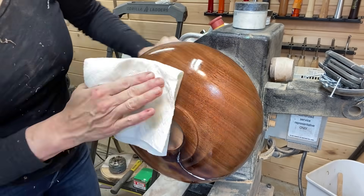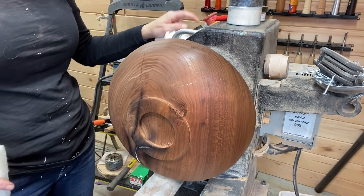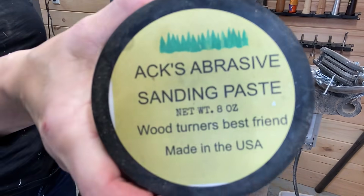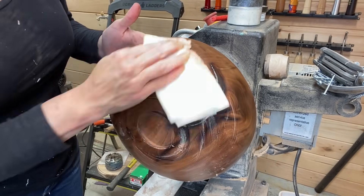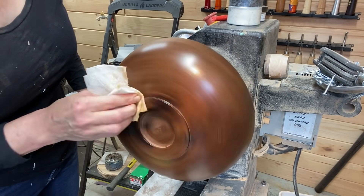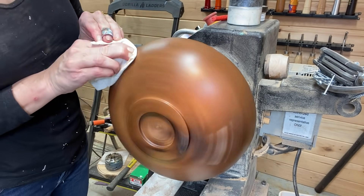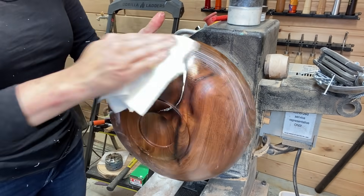This is sanding sealer — I use sanding sealer mixed with denatured alcohol, 70/30. After that dries, I use a Scotch-Brite pad and de-nib it, making sure there are no little fuzzies. Then using the Axe Abrasive Paste, which I use on 99% of my projects. I do have a discount code for Axe as well in the video description — please check them out, you'll be glad that you did. And this is the Axe polishing step two.